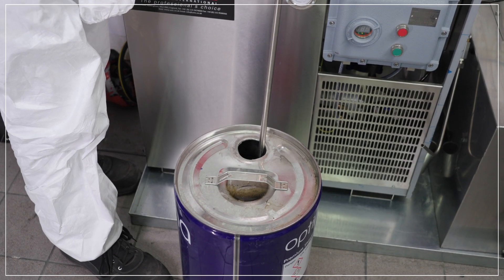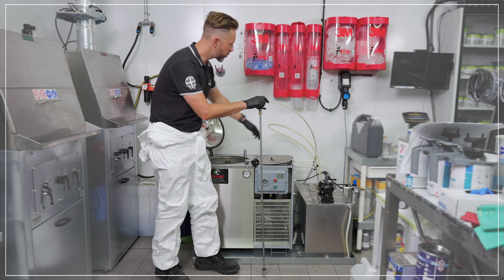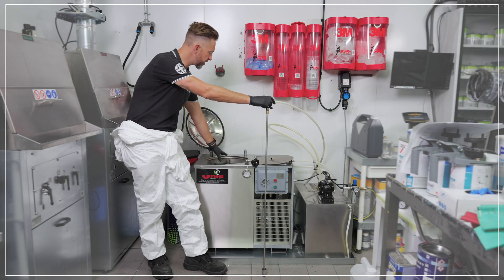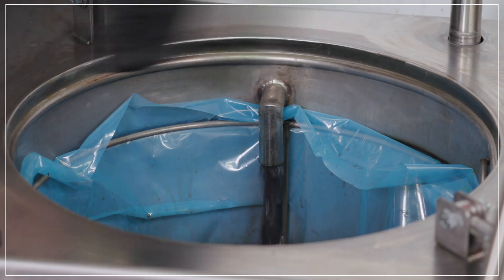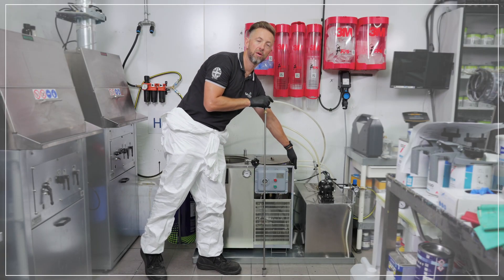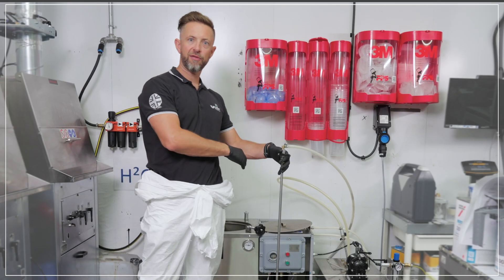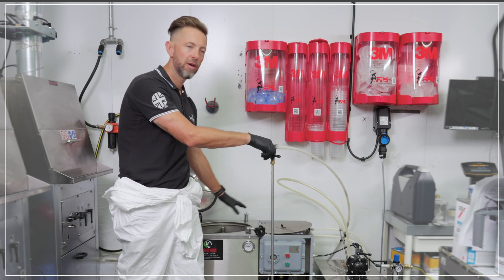You open the valve to allow suction coming up, then switch the pump on at the side of the machine, which will assist you and fill up the tank inside. Once it's full up to its capacity you can switch the pump off on the side of the machine. This is a semi-automatic filling system where you'll have to switch the pump off manually by the switch.